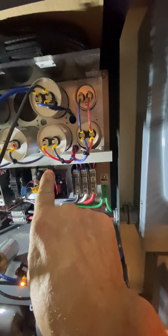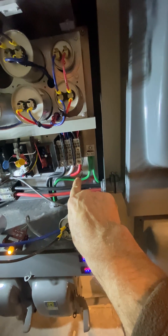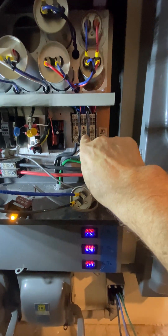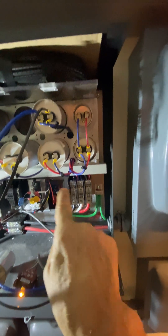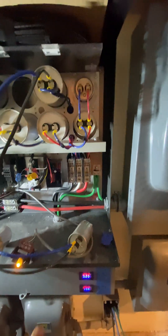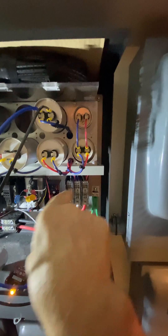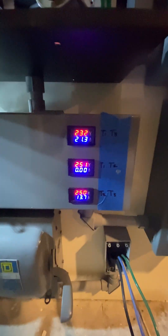The red wire is actually the red from the three-phase, and the capacitors feed the blue — or in this case the white — the generated leg. Originally they had 300 microfarads on the red and only 25 on the black. I've now got 175 on the black and 175 on the red, and these are my voltages.